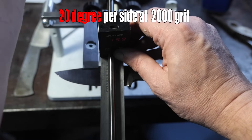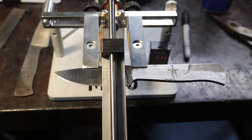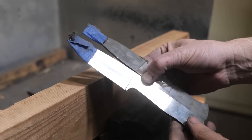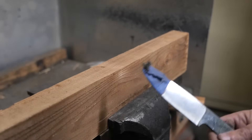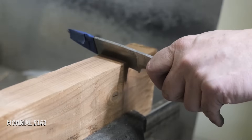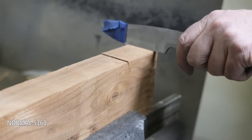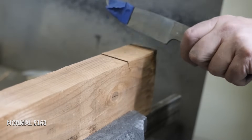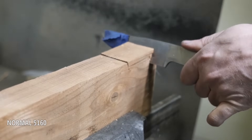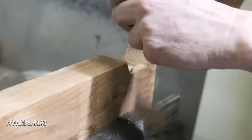420 cuts in the regular 5160 and 550 cuts in the carburized steel. Let's take the bevels to 20 degrees to add a little bit of edge durability and try some batoning to stress the edge and see how tough these steels are. I think we already have a clue that one of them is probably not as tough as the other. This board is dried cedar - it's a little bit harder than the pine studs I've been using, but it chips away better so it makes testing easier. I'll probably start using this in the future.